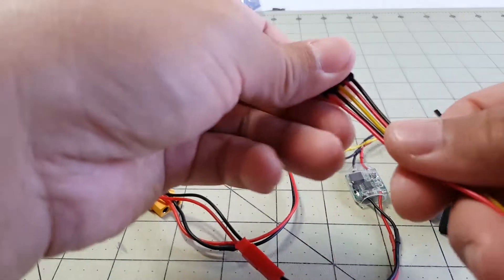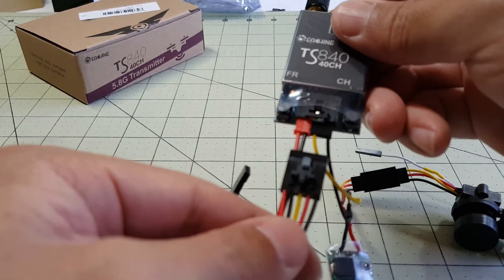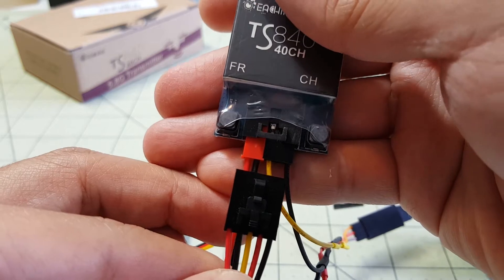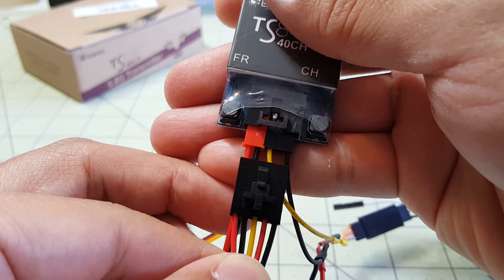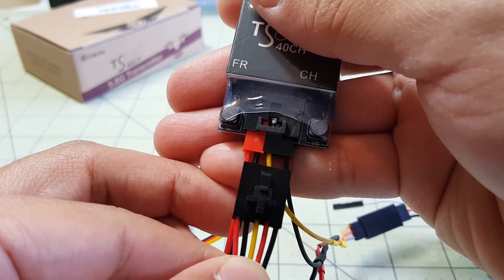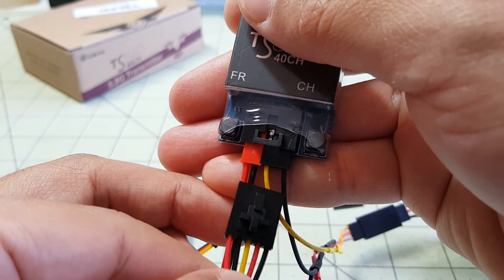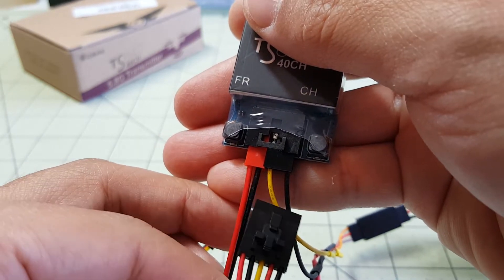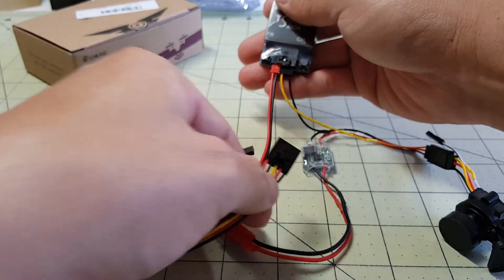I made sure that I matched up my connections here with the same ones on this connector. The far left pin is the positive battery voltage, then you've got ground, then that yellow pin in the middle is the video, and then ground again on the right. That last pin has no power — the same battery voltage comes out over there — so that's why I don't have that pin connected, because I have this set up with my 5-volt regulator.